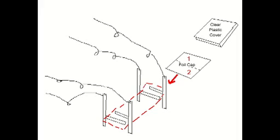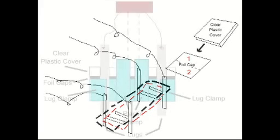To hold it all down, contact has to be made on those little arms on the bottom and top of that piece of foil. To hold it down and push those all together is the plastic cap or plastic cover that fits across the top. You can see that the plastic cover fits over the top of the mica capacitors, which are in between those arms. It pushes everything together and the arms make contact both on top and bottom of the mica foil sheet.